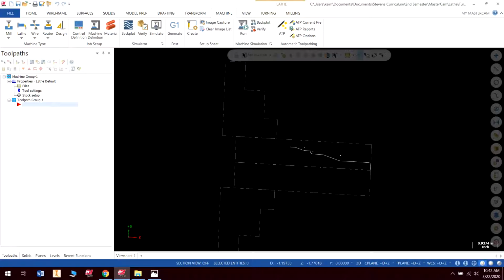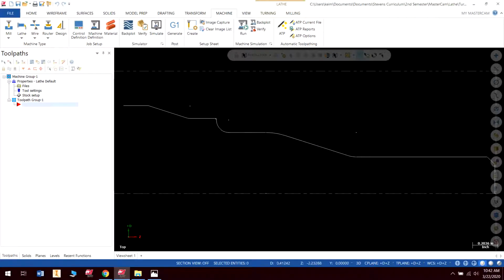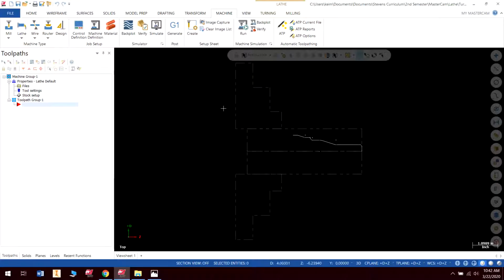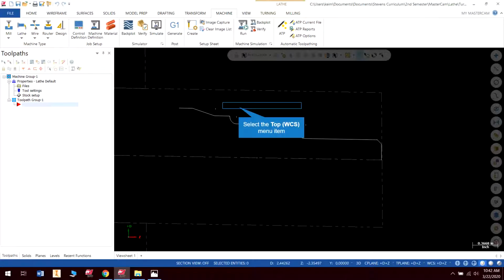Save default settings. Check. Yes. Okay, there, I think it saved it now. I think I forgot to hit save default settings. That was my problem. Okay, so now we should be good. And the next tutorial I do should already have the jaws preset to grab onto 1.5 inches. It's just a matter of how long I make my part. The margin will always have an extra 2 inches. So, all right, let's take a look there, and let's go ahead and start programming this.